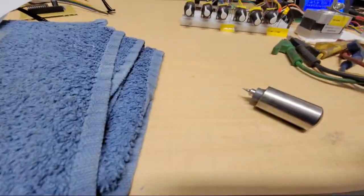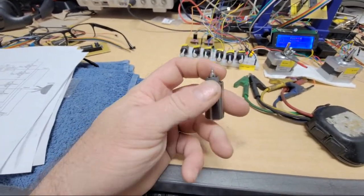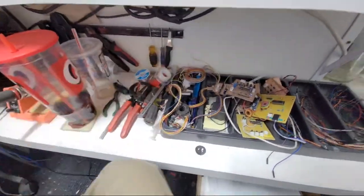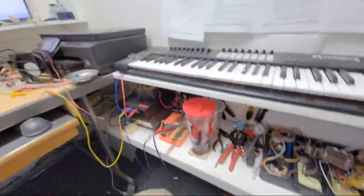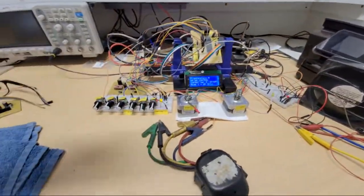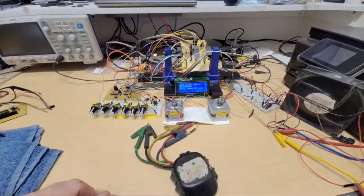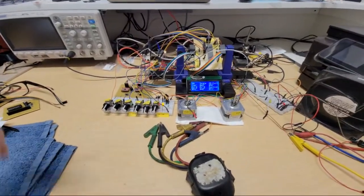There we go. There's your little needle inside your electronic expansion valve, and it opens and closes. Opens and closes. I have a big electronic expansion valve around here somewhere too, that opens and closes. Fan speeds up again when it's on the outdoor one. And of course, if I just turn everything off, it's going to go to mode 0, which is off. It's going to close both of these.